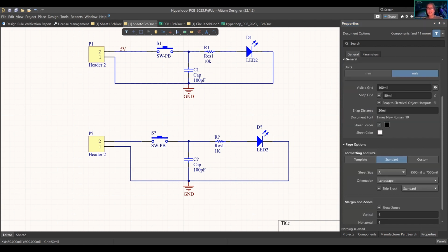Obviously it's different if we would be using something different. So there's a fabricator and there's assembly, right? Your fabricator essentially creates the actual PCB, with no components on it. That's what a fabricated board means. First the fabricator compresses all those core copper layers together, creates the copper interconnections within the board, and then creates the silk screen and the legend.